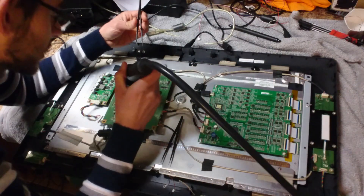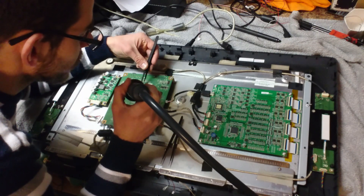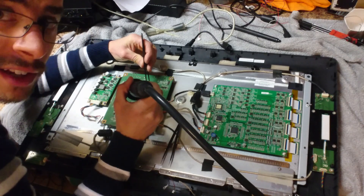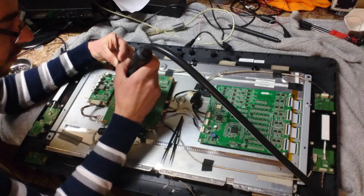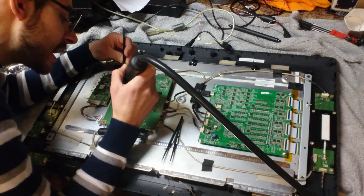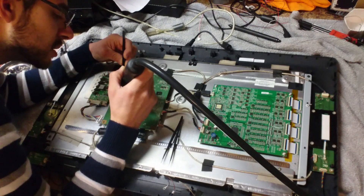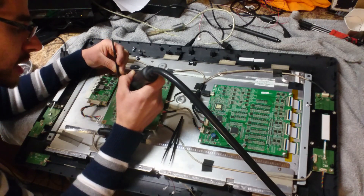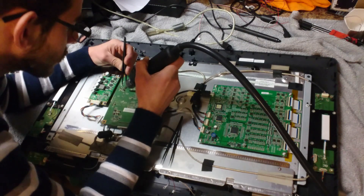Alright, I'll chip that off a little bit and then pull out my chip — and then I'll drop it. Luckily I remember the orientation I'm supposed to be in, otherwise I would have just flipped it upside down. I'll change the orientation for the next one so we get a better view. So we're back, putting it in — dot in the top right. Wow, I just noticed there's actually a little white dot on the PCB as an indicator for which corner the dot is supposed to be. I did not know that. It's there for all of them — that is super duper helpful.